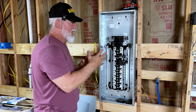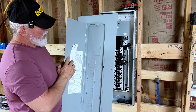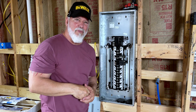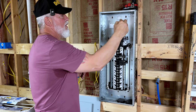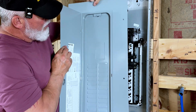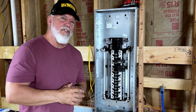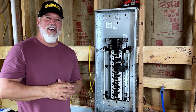That covers the basics of a panel. The cover mounts here — when you go to mount it for the first time, the screws they give you are not threaded, so you'll need an impact driver to drive them in and get them threaded. You're also going to want to label your breakers; they do generally include labels — GE does. That's the basics of a service panel. If you're not a subscriber, please consider subscribing and ring the bell notification so you know about all upcoming videos. We'll see you on the next one.